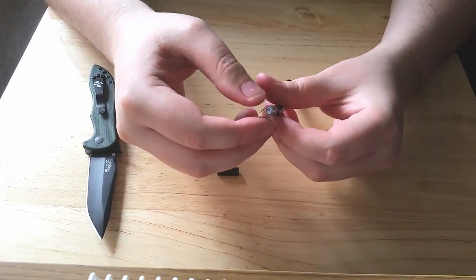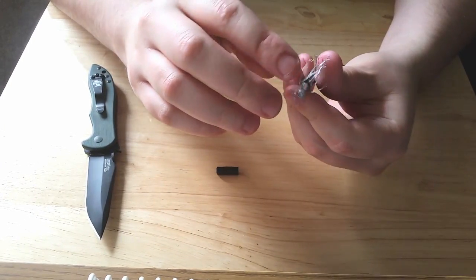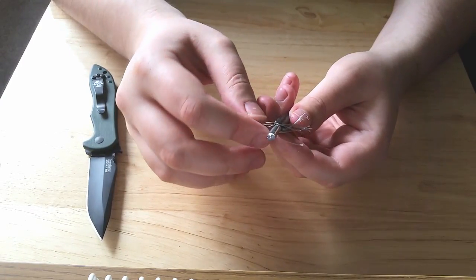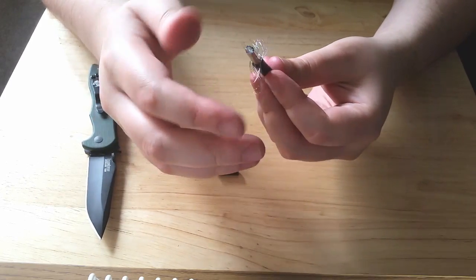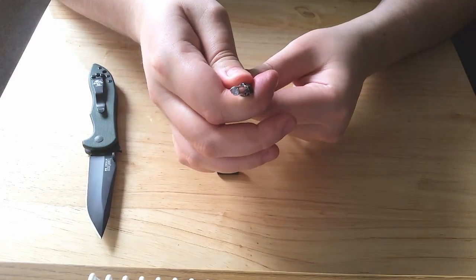That leaves you the intact strands of wire. What you do is just peel these back. I've left these a bit long — because they're so long they'll pop out on the other side of compression connectors, so just trim them down slightly if you want. I'm just folding them back, making sure they don't contact the copper wire inside, and just twist them back so they're nice and neat.